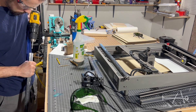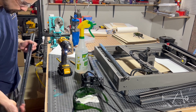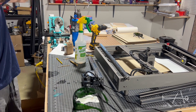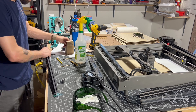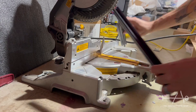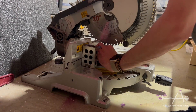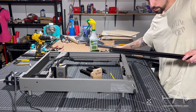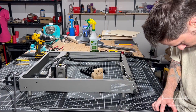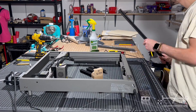Not all extrusion bars are built the same — sometimes the hole in the middle accepts M5 screws, sometimes M6. Mine was M5 but I only had M6 button head screws in stock, so I just drilled the hole and tapped them. The remaining extrusion is cut into four pieces to make the last parts of the frame. With a couple of screws I started to assemble the frame to get a feel for it and see if everything would work out.